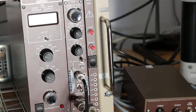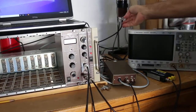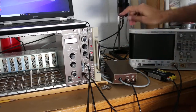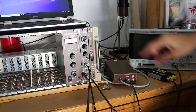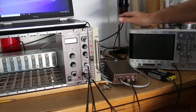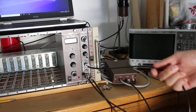So sometimes students ask, well, can't I just take the signal directly coming from the detector, put it into this amplifier and just skip the preamp? The answer to the question is no. That's what the preamp's for. The signal coming right out of the detector is just too small to do anything with, even amplified using this coarse high gain amplifier that we see here, so it has to go in the preamp first. So it goes into the preamp, boosts it up to a usable level, then it goes into the amplifier.